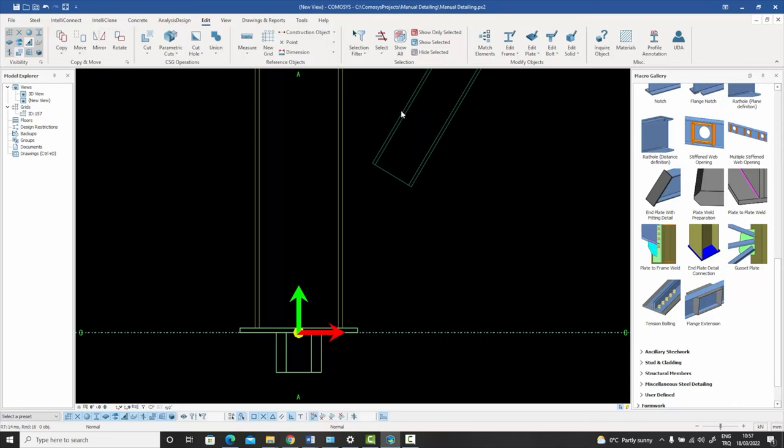I know that my two plates will be coming out like this — there will be about 10 millimeters on the side and they'll be coming down like that, approaching the column but stopping short of it, say a vertical line 20 millimeters away from the column. So let's construct that line using the construction line object, hovering over this point, pressing enter, and entering X=20. I snap to this point, press control, snap to another point, press enter, and say X=20 again — creating a vertical construction line 20 millimeters away from the face of the column.